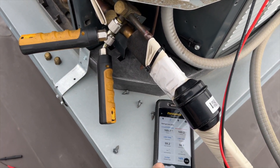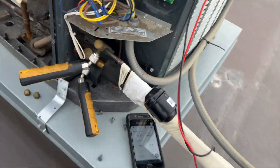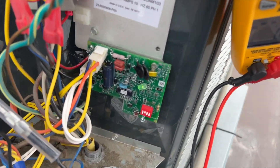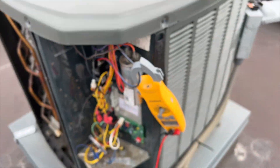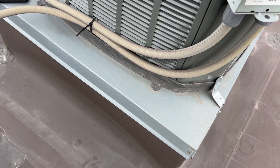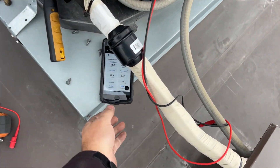Everything is hooked up. Off pressure is at 169.7 on both sides. I've got the inrush setting on my new meter. We're going to plug in the low ambient kit — notice that light is flickering a little, keep that in mind. Pulling the disconnect — contactor is closed. Compressor is running, but we do not have the condenser fan.